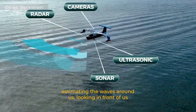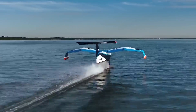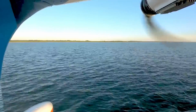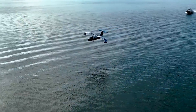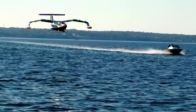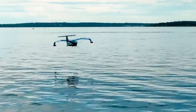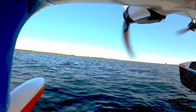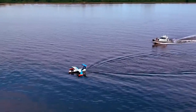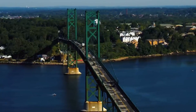This worries me a little bit. Because if you look at their craft, the geometry does not seem to be stable in ground effect — for this, the elevator seems to be too small. As a side note, I am not sure what the function is of the small spoiler at the leading edge of the elevator; comment below if you have any ideas. In general, especially so close to the water, you want the geometry of your skim machine to be self-stabilizing aerodynamically. This would mean that when your control system fails your machine is still able to be flown manually. If your machine is reliant on computer systems to keep it stable, this will almost definitely mean that you will lose control when you have to take it over from the computer.